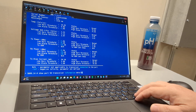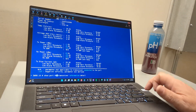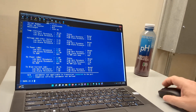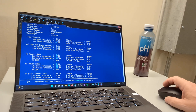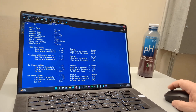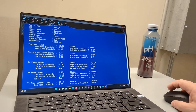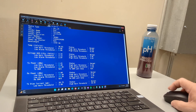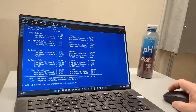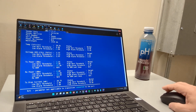Let's compare it to port 49. Transmit power is minus 2, receive power is minus 0.9. Transmit power on another port is minus 2.41, receive minus 0.9. Port 50 transmit power is minus 1.92, receive minus 0.54. They're fairly close — it looks fairly normal.